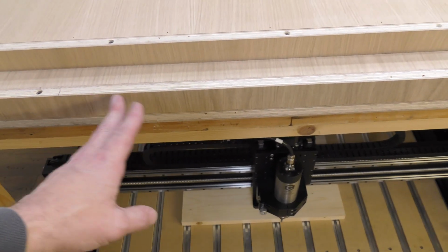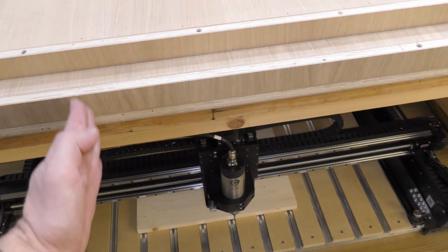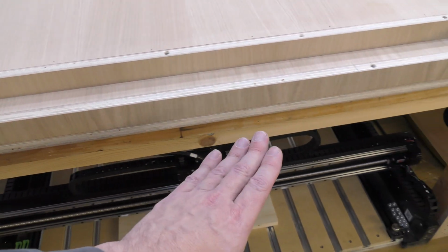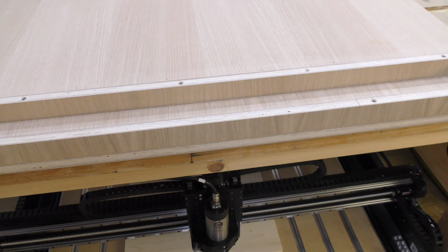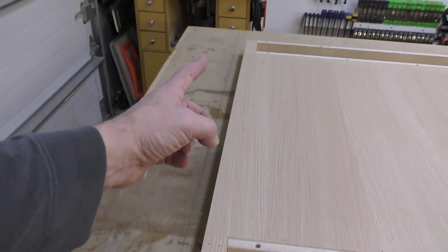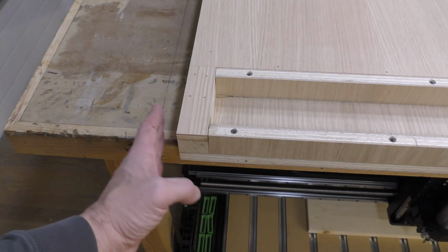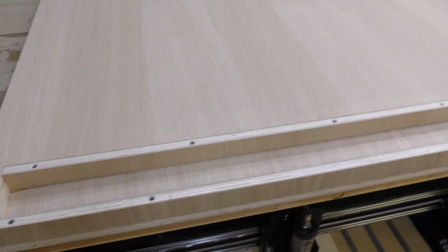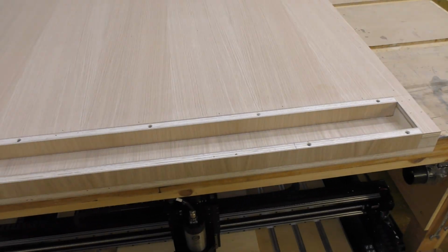So coming up next, once I veneer this face with vertical grain veneer, then I can route out the pattern for the arch that's going to go on either side, on the long side. This short side will only get edge banding, and the legs will tie into it right here on each corner. So yeah, that's the bottom. And now I'm going to go on to making the veneers.